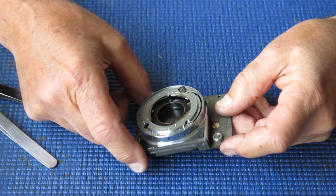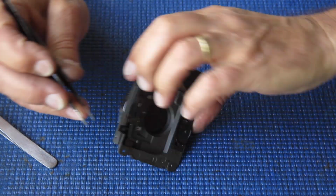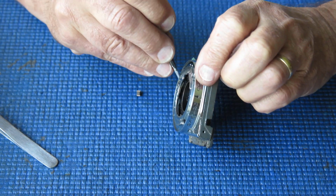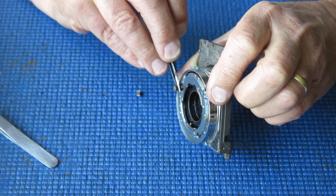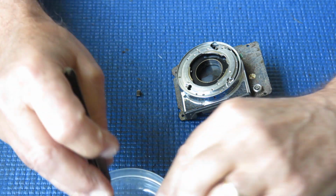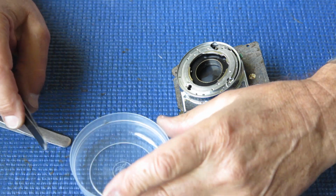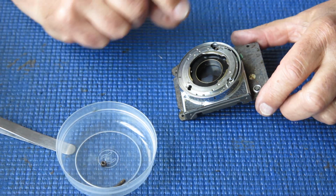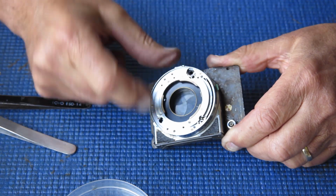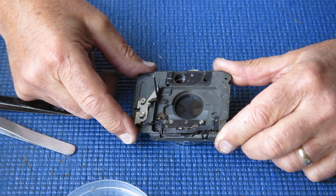The shutter assembly needs to be stripped down. We know it works after a fashion, but it's quite sticky. Certainly needs to come to bits and be cleaned. Those two components will probably need to go right through the degreaser. They couple the setting rings to the meter. There's a lot of that thick grease on the front face there. That certainly needs to go.